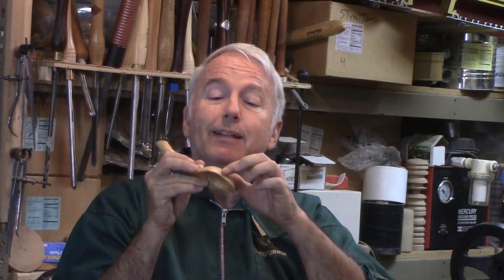One with a very round bowl on the end, and one with a more oval bowl on the end. The problem on each is how to hollow the bowl once the rest has been turned on the spindle. He demonstrated several methods from a jam chuck to an adapter in a scroll chuck to just using a scroll chuck. Those work for the round bowl scoop, but he also made the oval, mounting it into a scroll chuck with jaws removed, but it left distinct marks on the exterior of the bowl. On the round one I turned that into a decorative element, but with the oval one that's a much harder task to disguise or sand out those marks. So I wanted a better way.